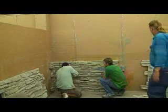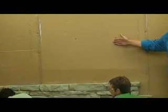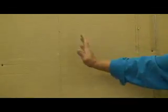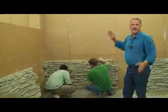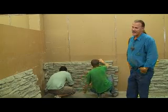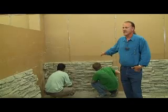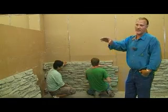Notice what we've done here. Because this is drywall, we're inside. Normally we're on an exterior wall — most cases on a frame building, it's plywood, which means I can drop a screw anywhere I want and I'm going to hit something. Notice the studs here. This is drywall and it's not going to take a screw, it's not going to hold. So they've located the studs. On a 16-inch or 2-foot spacing, you can screw into studs. I prefer the sheeting of plywood if it's there. If it's not, you've got to find your studs — metal studs, wood studs. Typically, I would want about eight screws in this panel, and that's going to hold it.